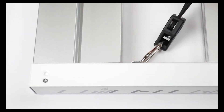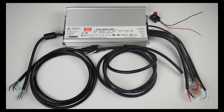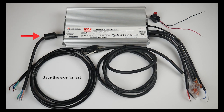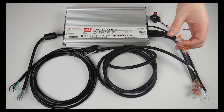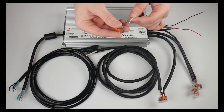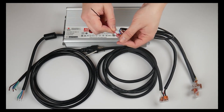Once all the connectors have been wired in your kit, slide the cover and secure it to the U-frame. Then secure the PCB covers and attach your hooks to the four hook points on the frame. Next, you'll be wiring the driver. Each Growcraft order comes with a Mean Well driver to power your light. To wire your driver correctly, first identify the input end which connects to a standard 120-volt wall outlet and the output end which connects to your Growcraft. Important: do not wire and plug in your input to a power outlet until you've concluded the wiring to the Growcraft and are ready to turn on. Any unused wires should be covered by Wago connectors to protect you from electric shock. Locate the black and red cable on the output end and connect it to the 48-volt cable on the Growcraft power board, making sure negative wires match one connector and positive red and white wires connect to another. Then take the cable level dimmer switch — blue and white — connect the positive blue driver wire to the red positive dimmer wire in one connector and the negative black and white wire to a separate connector.